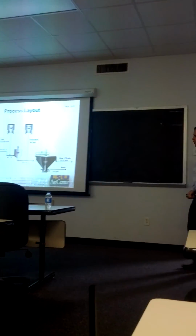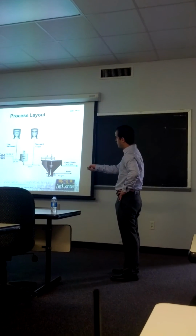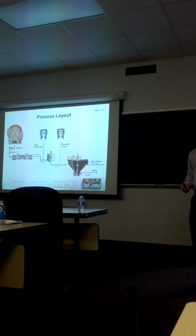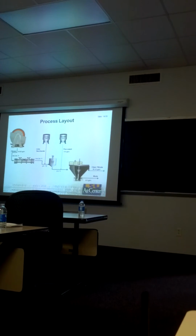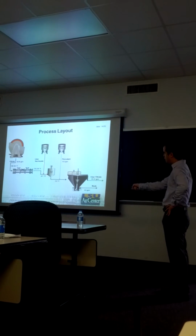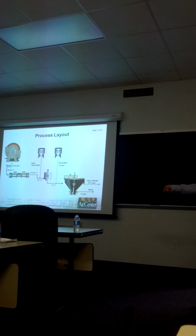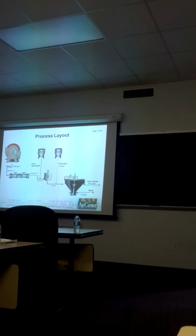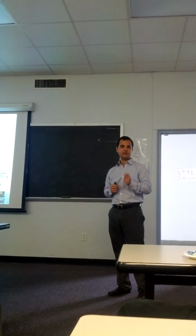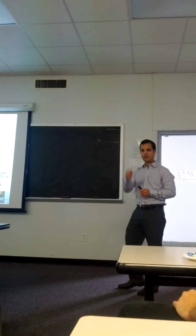The process that was proposed to treat the filtrate from this factory consisted of the following: we sent part of the factory filtrate to the heat exchanger, and we heated it in one stage to above boiling point, just to slightly superheat the filtrate and be able to degas it in the external flash tank. Before, we added some lime to adjust the pH and the flocculant. Finally, all the filtrate is sent to the clarifier where the two phases are obtained, a clear filtrate and the muds. Because this was an experiment, we didn't want to affect the performance of the factory in general. So after sampling our clear filtrate, we mixed these two streams again and returned it back to the operation.